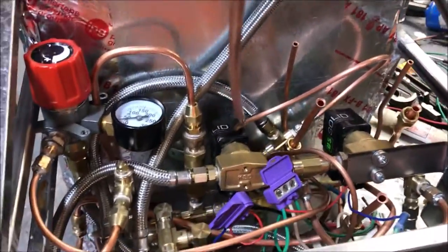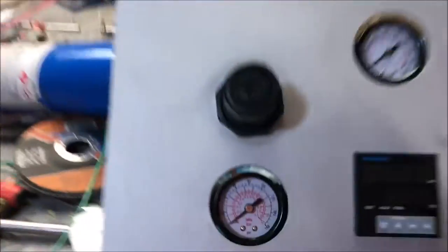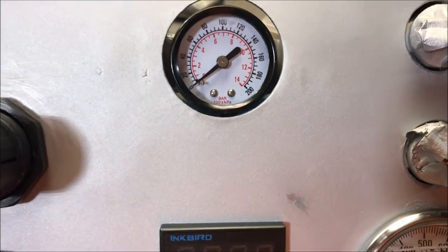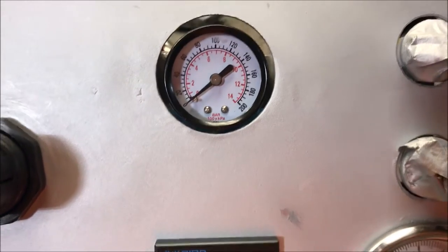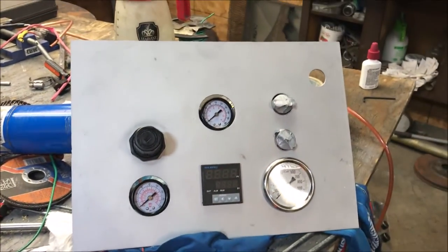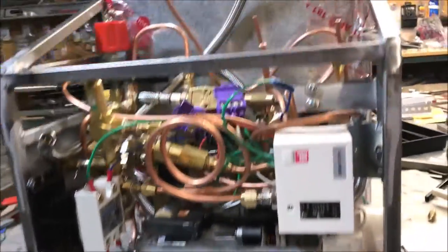It also has a high-flow air breather, and the burner itself runs at 80 PSI. Right here is the regulator and pressure gauge — this is going to be our tank pressure. Propane tanks usually run around 120 PSI, but once you start running them the propane boils in there, gets really cold, and the pressure drops off substantially. So we're going to want to monitor that — that way when things start getting weird we'll be able to see exactly why. So there it is, man — this thing is just getting cooler and cooler every day.